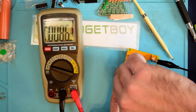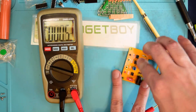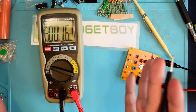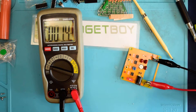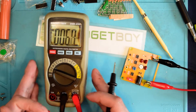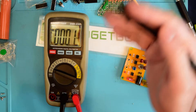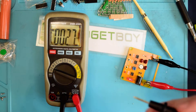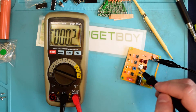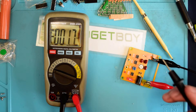Apparently I don't actually need to calibrate these. Now, the reason why you calibrate over multiple ranges is because, especially with an auto-ranging multimeter, it changes the components that it's using to read the voltages. So you kind of average it across — you calibrate it on the high end, you calibrate it on the low end, and then you work your way in from there. You do the 10-volt and calibrate it, you do the 2.5-volt and calibrate it, then you do the 7.5 and then the 5, and by then you've got your adjustments in quite accurately.